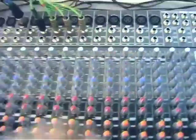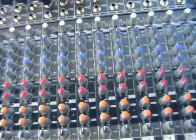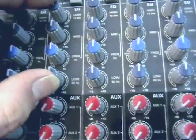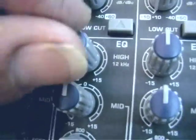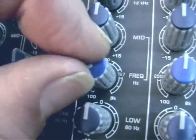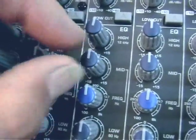What does this EQ actually sound like? It's a £325 board and the 16 mic preamps are very nice, silent, and have tons of range. The EQ is pretty much the same — smooth, warm, musical. It's the same specs as the Mackie VLZ: 12kHz top, cut or boost 15dB; 80Hz bass, cut or boost 15dB; and a sweep mid where you select a centre frequency between 100Hz and 8kHz and cut or boost by 15dB.